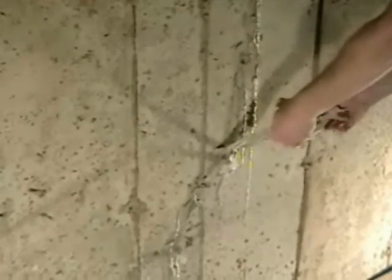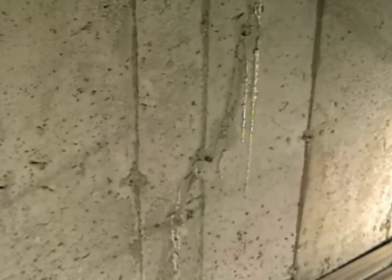And there's foam in there. Just as you peel the surface seal, it's gonna pull a little bit out of the crack. If you want to improve the look of that, you can get a light colored concrete patch and just smear it over the area, and you can make it disappear. If you smeared it over that whole square there, it would go away. And that's a completed repair done like a professional. Won't leak again.